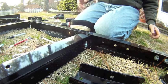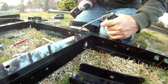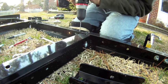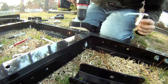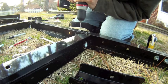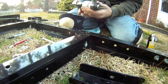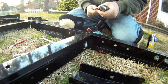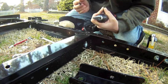The next thing I'm going to do is drill a small pilot hole — I think it's an eighth inch or maybe a little bit bigger. I put a little bit of oil down and I'm using a step drill. I want to drill a half inch hole, so I'll take my Sharpie and mark the step drill at one half inch, just so I can see when I reach that point.